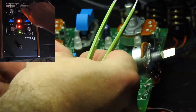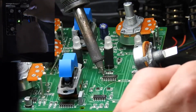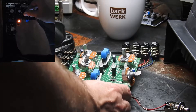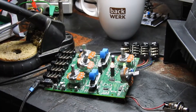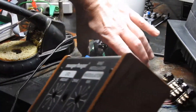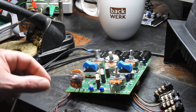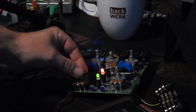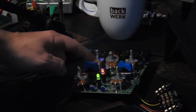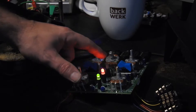Let's power up. We have different color lights — I'm really not very good at remembering where the controls are. We have the mute on and mute off. You'll also notice that the signal light isn't fully red — obviously the chip we just replaced was also controlling that LED, and each LED has three pins which is how they get both colors.